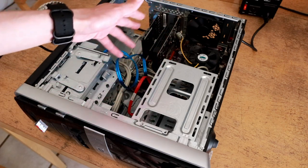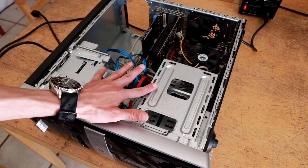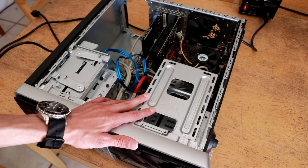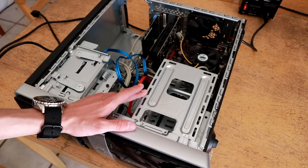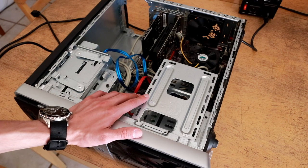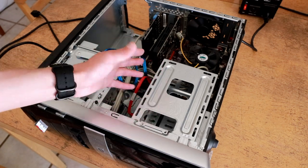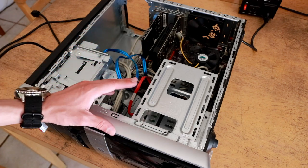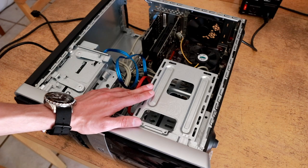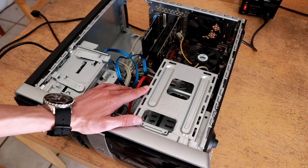Between the hard drives, motherboard, fans, and graphics card under full load with Prime95 and FurMark — that's the configuration I'm using. I'm using a smaller machine not only because I don't want to immediately overload the power supply, but also because if the power supply shorts out or generates erratic voltages, it won't blow any expensive equipment. I certainly wouldn't test my high-end gaming rig with a GTX 960 and quad-core CPU with this power supply when it's been totally untested.